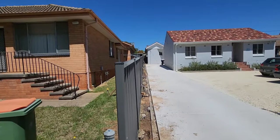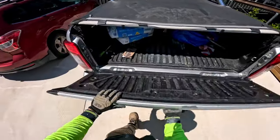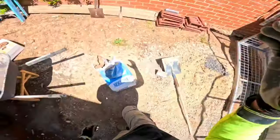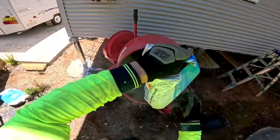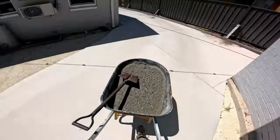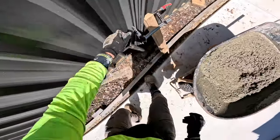And that's it all set up — much, much better. So now we'll just do the concreting. For the concrete I used a ratio of one part cement to seven parts concrete mix, which already had the sand and aggregate mixed together. Now you're just going to fill them full of concrete and give them a good jiggle so the concrete gets all the way around.